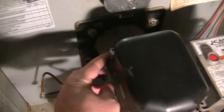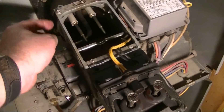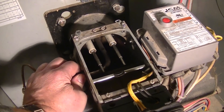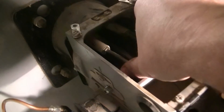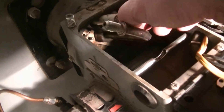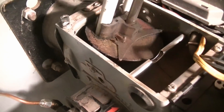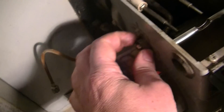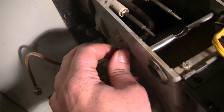So what I did — there are some tabs, you can pull this off and check. I had a spark. If you take this off, you can pull this gun out — that's what they call it. There are the two igniters and then the fuel nozzle on the end. You can pull it right out. I took the nut off of here, and then you simply turn it, wiggle it just right, and pull it out. My spray nozzle is fine for the fuel, my igniters are fine, so there's no problem here. I'm going to go ahead and put this back in — make sure you put the flat side towards the nozzle. We're going to tighten it up.